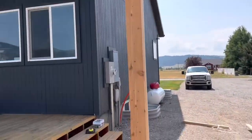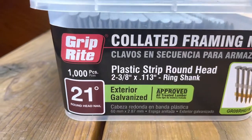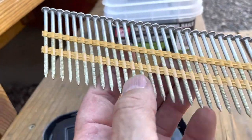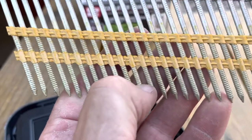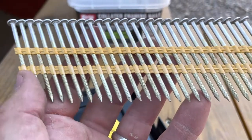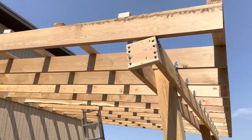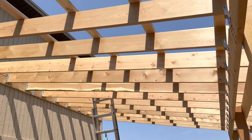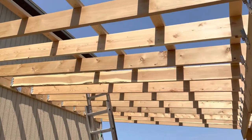I went with ring shank nails - I would have liked three-inch but the only ring shank came in two-and-three-eighths. With the ring shank it has a plastic or glue-ish coating that they said will melt when you fire it and adhere, and then the ring shanks really grip it almost like a screw while still giving some flex. I read about a method where you throw one screw and two nails in, and I might go back through and do that. My brother in construction said he doesn't even use ring shank and just uses smooth shank for purlins.